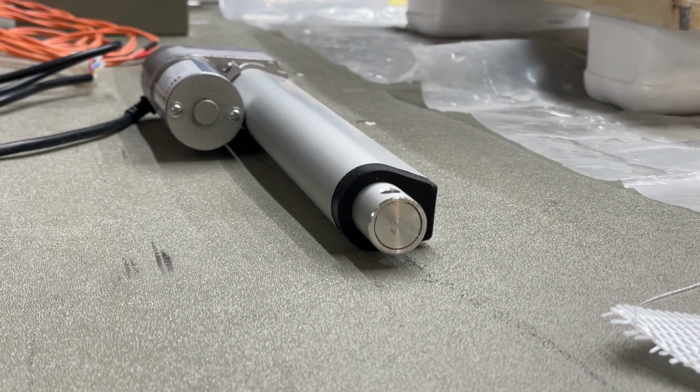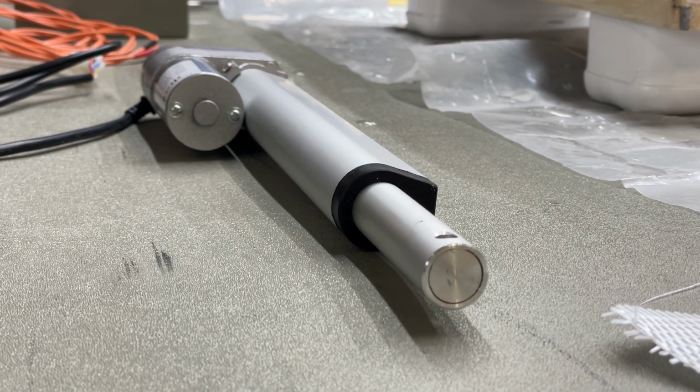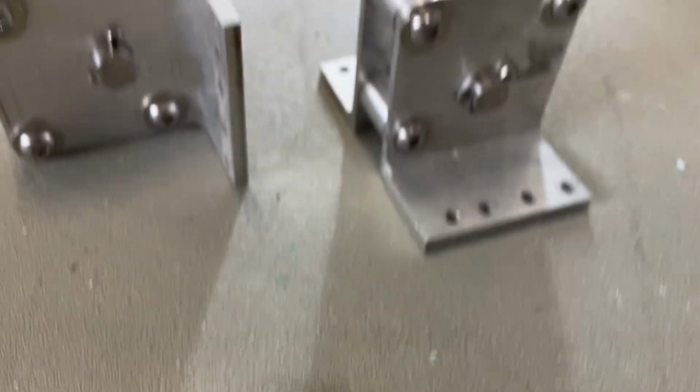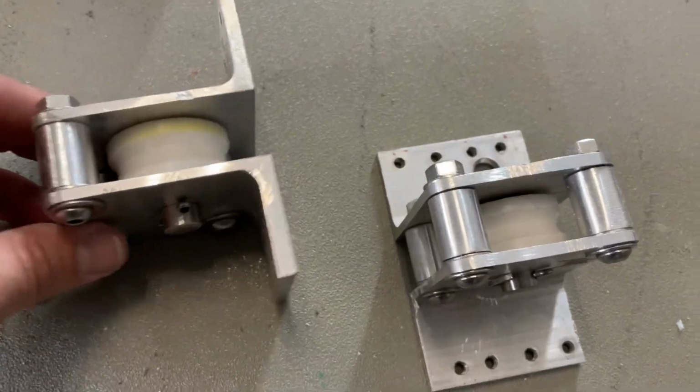We need to keep in mind the increased risk of this battery chemistry and design redundant monitoring systems for battery temperatures. We are keeping in mind that a drive-by-wire servo-controlled steering system might be less responsive compared to a standard mechanical steering cable. Although we need to be able to drive by wire when unmanned, we plan to disconnect the servo to allow for manual steering when the boat is manned, using a cable-driven mechanism we've begun fabricating.